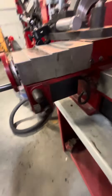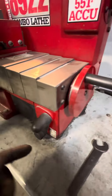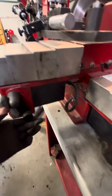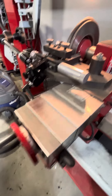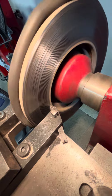Once this is all set up — we've got it set up for rotor feed, with rotor and drum feed on and off — when we're doing the rotor, we don't want this to walk forward, we want this piece to walk back. So I have the feed turned on and the other off. Once we engage it, this runs at a fixed rotating speed, and you can see it's starting to just walk back as it cuts.